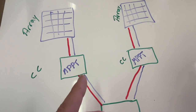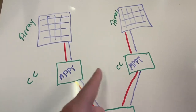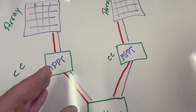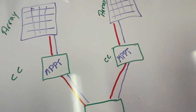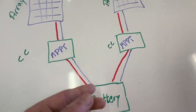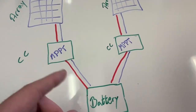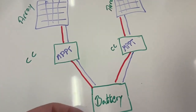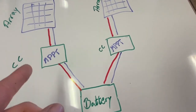Some systems offer communications between MPPTs, enabling them to share information from the battery. Usually one MPPT is the master and the rest are the slaves, so you get coordinated charge states, synchronized absorption to the battery, centralized monitoring, and even smarter temperature sensing. But it's more expensive and would be overkill if you don't have a big system.